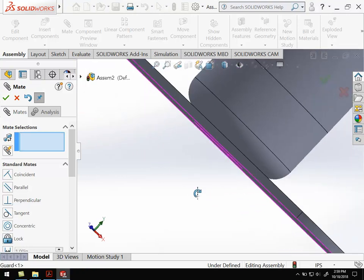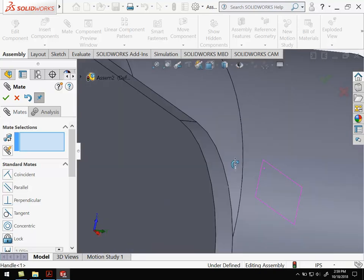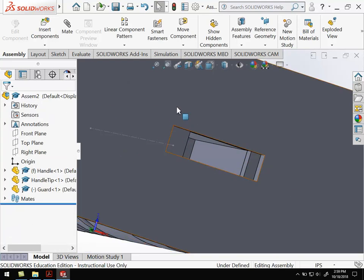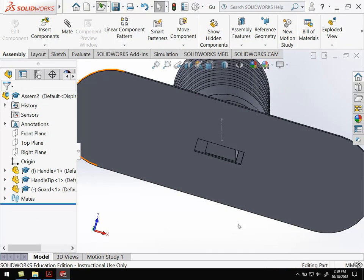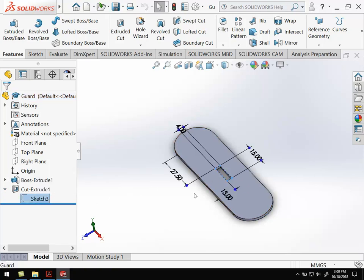At this point I'm going to notice something — these two holes are different sizes and they really shouldn't be. So this is a mistake I made in the guard piece that I've allowed to happen so I can show you something. Basically the hole is bigger in the guard than it is in the rest of the handle. I want to fix that, so I'm going to go back to my part. I'll hit OK on that last mate and go back and open the guard piece — it'll keep my assembly open in the background. So here's the guard. What I'm interested in is the rectangular cutout. If I click on it, this was 15 by 4, and really the holes in the handle, handle tip, and arm pieces are all 10 millimeters. So I made this too big.